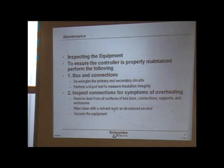And of course, if they've done that coordination study for the settings for the breakers, then at that point they already have those numbers to do the arc flash analysis for you. So it would behoove the utility to take those same numbers, go back to that same engineer and say, look, give us an arc flash analysis now. And it probably would be maybe a little bit cheaper because he already has that number.